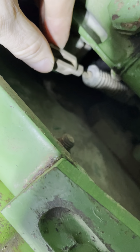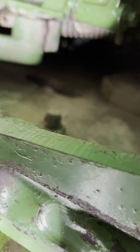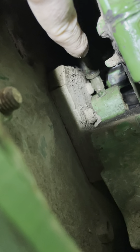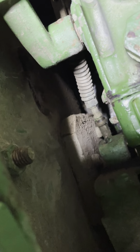There is the other end of the clutch cable, and that sits up through an eyelet on the other end — hook up there. You can just see it now, so you sort of have to fight to get that off. And again, you have one of those little clips that goes around the cable there — just pop that one back in — and that clips on that shoulder and holds that cable in. Once you've undone the left-hand end of that saddle on this clutch lever, that whole cable just comes off.